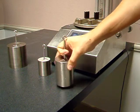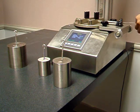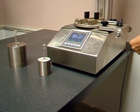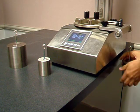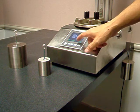In the next step, hang the weight on the other side. This is to calibrate the transducer or the display both clockwise and counterclockwise. And press the next key.